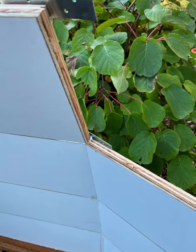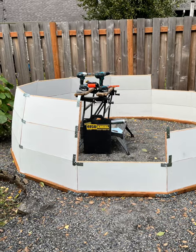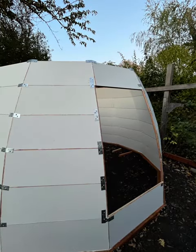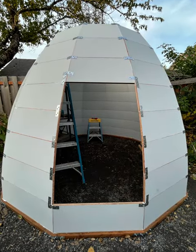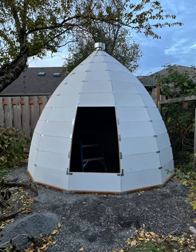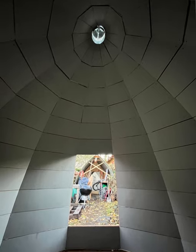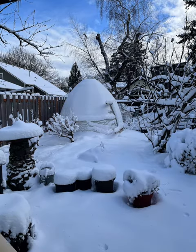Instead of cutting a doorway into the dome, I left panels out of the assembly. I chose a smaller than standard door, but a standard entry door could be designed into the structure. The panels are adhered with polyurethane sealant, which off-gassed for over a year — I recommend using a low VOC sealant or construction adhesive. I used expensive Simpson Strong Tie straps and stainless steel screws to hold the joints while the sealant cured. Next time, I will use a one-inch wide crown staple with five-eighths inch legs and not remove them.